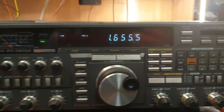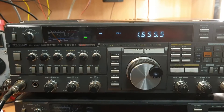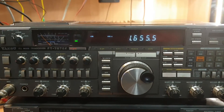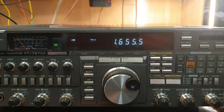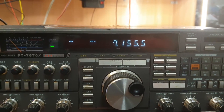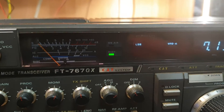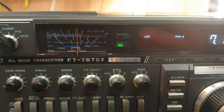You'll be watching this being tested live as I'm testing it, because lately I've been doing that. Some videos, people go, why would you do that? Because you just showed us a fault. Well, you've got to fix the faults anyway, so I might as well show you when they occur. And it saves me doing it twice. So — does this thing receive and transmit? We're down to 0.2 of a microvolt and I can still hear it at 0.1, still hear it at 0.05. It receives beautifully.